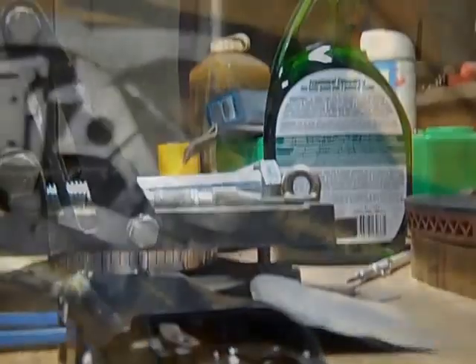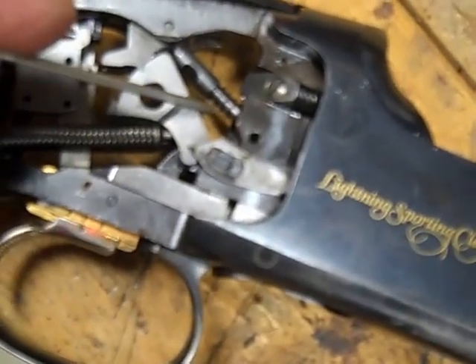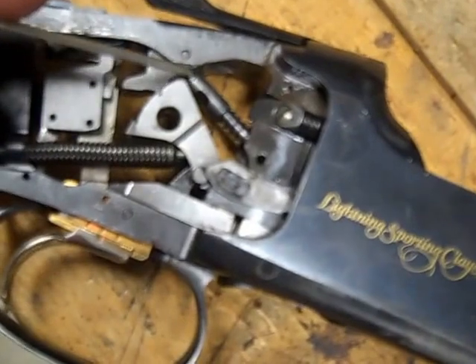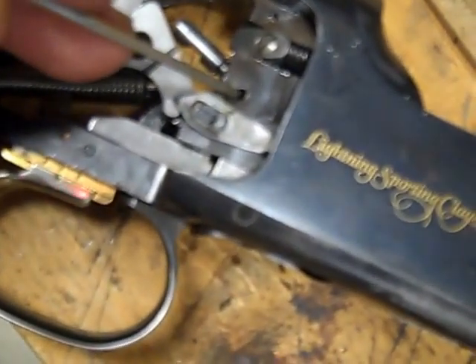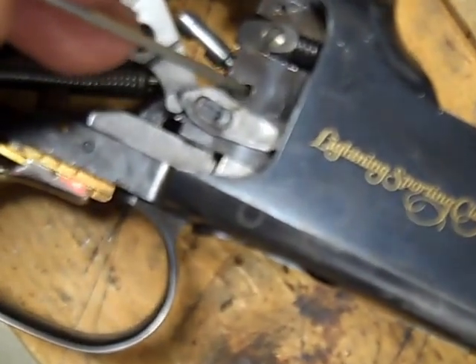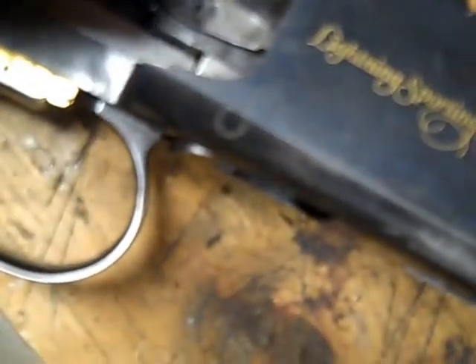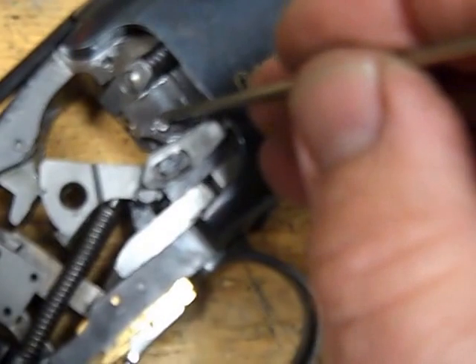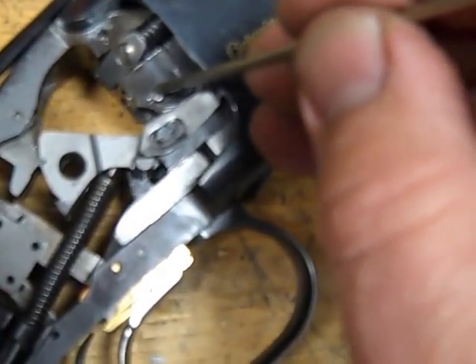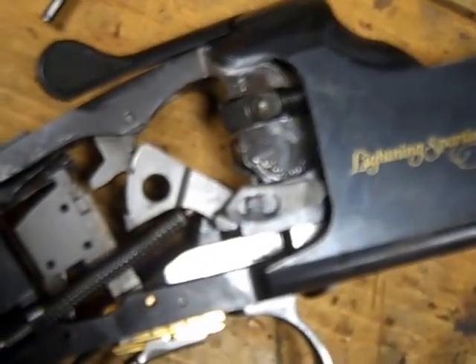If you line up the notch correctly, the retaining pin will slide all the way in without much effort, all the way up to its little knurled end, and that just needs to be tapped back in. That should do it. So the firing pin for the lower barrel is inserted here — this one has the little spring on it, the one from the upper barrel doesn't. Again, you make sure you line up the notch in the firing pin so that it will align to the retainer pin hole, and that will just sneak right in there. So I got that firing pin back in. This is the retainer pin — it's punched back in from this side, and that's back in place. So the firing pins and retaining pins are all back together.